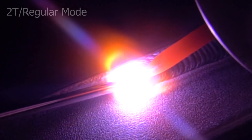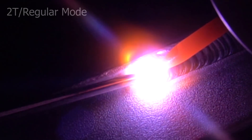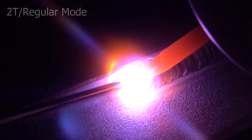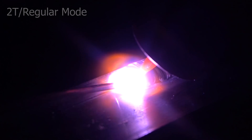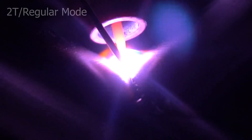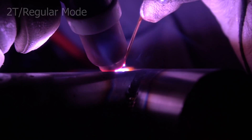Here's some stainless work from a separate episode all about stainless steel — I was using the HTP the entire way through. You can see how ridiculously smooth and controlled this arc is. Now let's check it out on regular mild steel with very fine precision work. This is super zoomed in — that filler rod diameter is 0.045, tiny stuff. You can see a nice, buttery, smooth, perfect arc the entire way through. And of course I test machines on tubing because I do a ton of tubing work. You need that nice, perfect, controlled arc to weld tubes, and this one delivers. Zero fits the entire way through — perfect, buttery, smooth arc. This is stuff we usually dream of having.